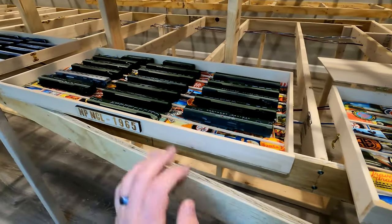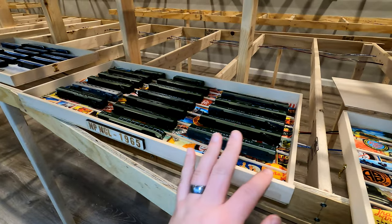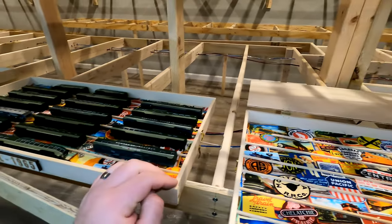The way I did it was: I did the front and the back, clamped them in place, then glued the sides on, clamped them in place, left it to dry overnight, and then it was good to go. If you're doing one of the lower boxes like this one — that's got my North Coast Limited in it — that's really all there is to it; you don't have to worry about doing the lid.